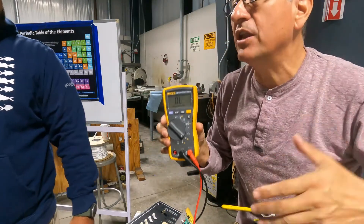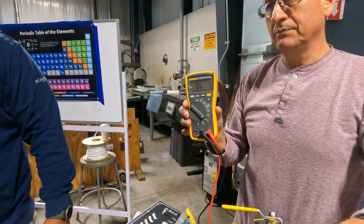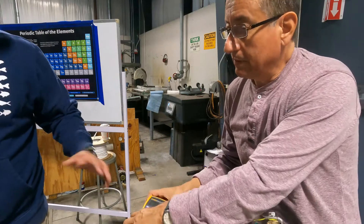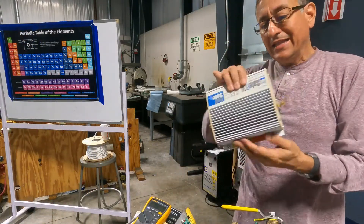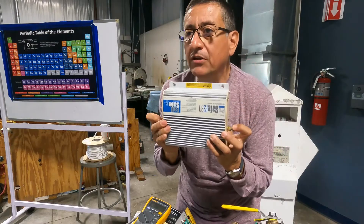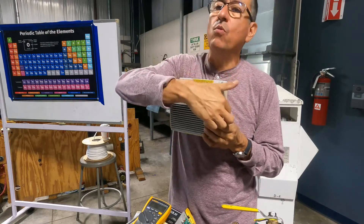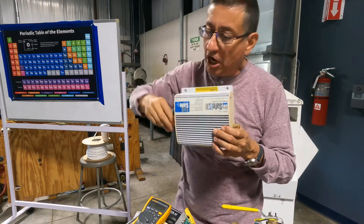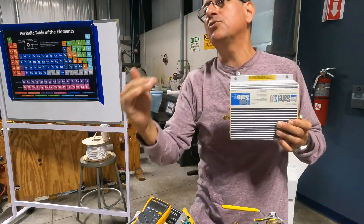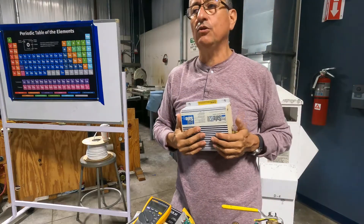Any type of galvanic isolator, the procedure is the same. You need: number one, disconnect the ground on both sides; discharge the capacitor; start the reading in one direction; then discharge again and read in the other direction. The reading should be going up from 0 to 0.9 in both directions. Finito.